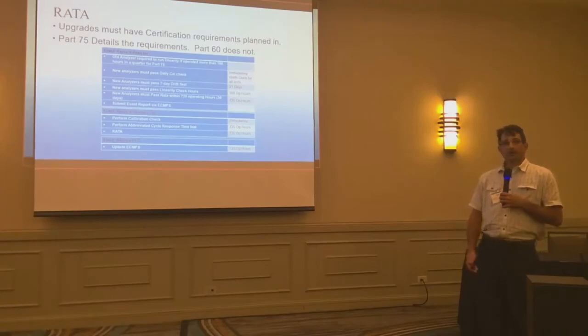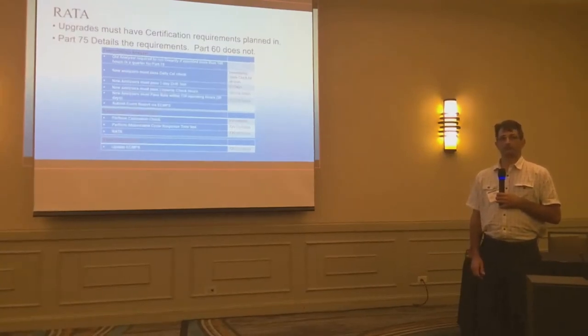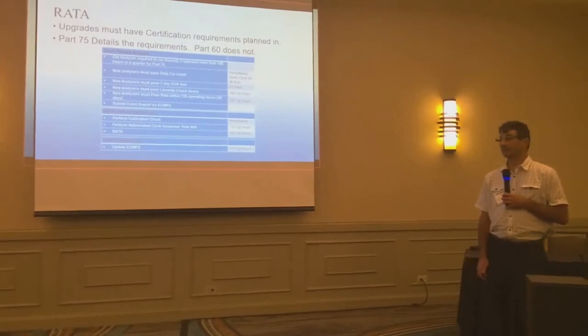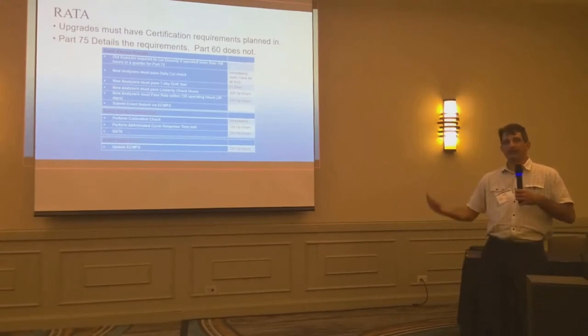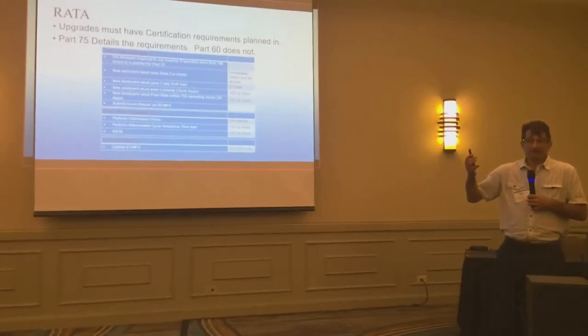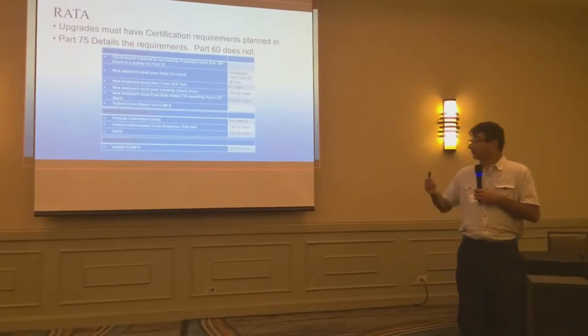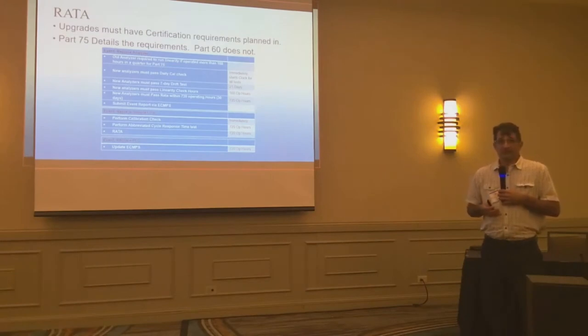But there was some equivocation in how the EPA responded. It does appear in the response from Charles Prescott that you wouldn't have to do that second one, but ECMPS will say the opposite. It's not a hard test to do. I would say be on the safe side and do it. It turns out that if you replace the analyzer and didn't do the QA on your old analyzer before you replace it, it might get flagged by ECMPS.